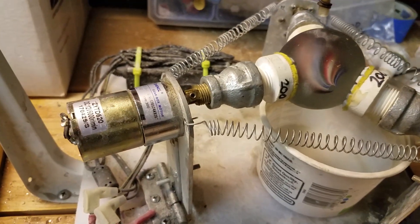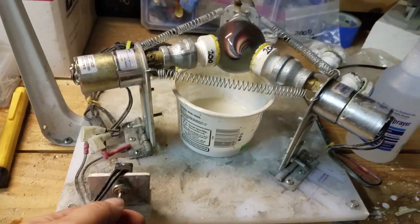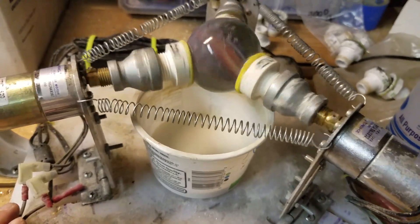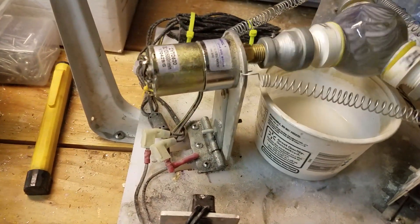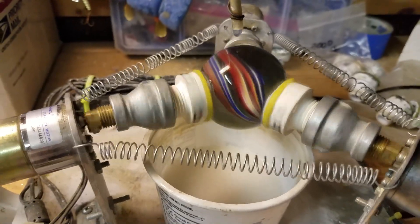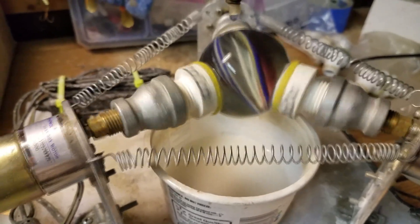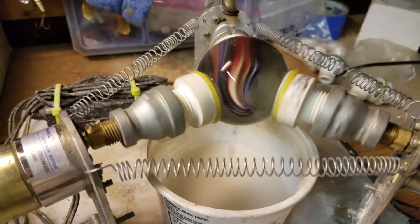I've got the cups in there now. Let me get a good spray and get everything nice and moist. This is the 200 grit. Those cups have never ground on a marble this big before. The 200 grit has done a great job — it's a lot clearer and brighter now. Those cups finally broke into this big marble and they're not squeaking, so it's just polishing it so nicely and turning it so well, seeing every little side. I'm just going to let it run a little bit longer to make sure we get all of the 100 grit scratches out.